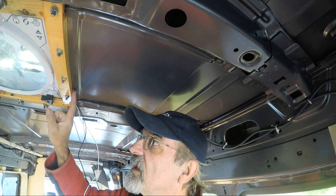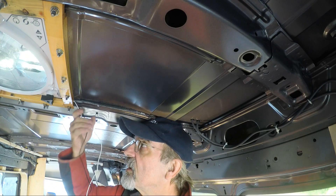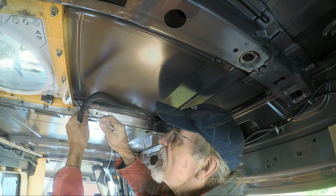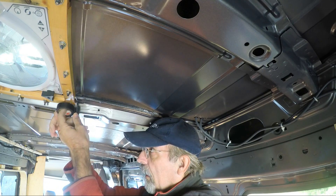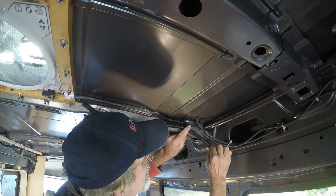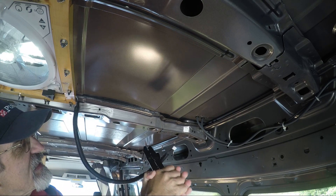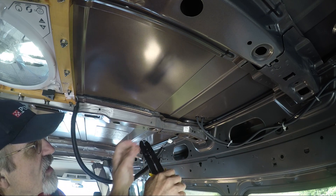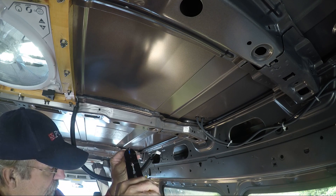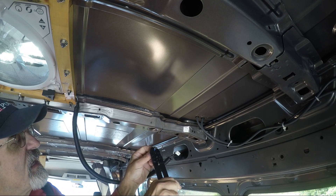What are we working on today? It's just a temporary connection from my solar panels on the roof end to the bus bars, so I'm pulling the wire. The black is, by the way, a positive. I'll guide it through the interior adapter that I made, then along the roof crossmember to the side. The wire coming from the roof end is a 16 gauge wire, but to cover the distance and avoid voltage drop, I should switch to a slightly heavier cable, so I chose to use a 14 gauge wire to continue to the fuse box.